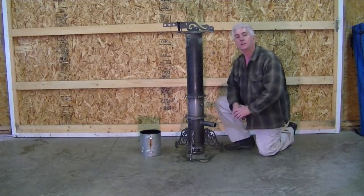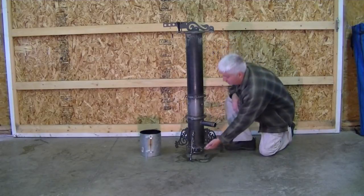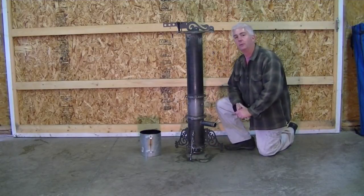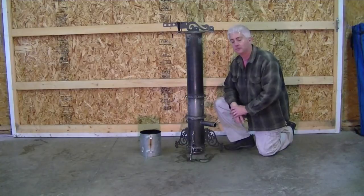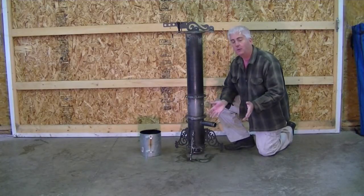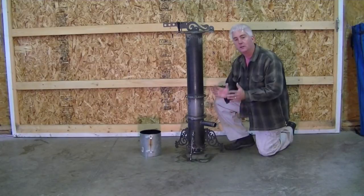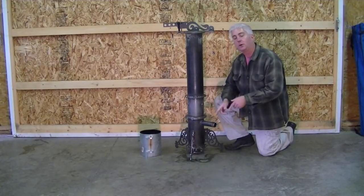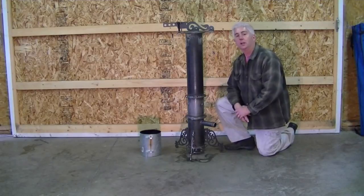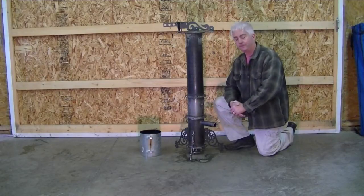First things first, she finally gets the long overdue ash cleanout, and it's the bottom plate — you undo the bottom flange, the bottom comes off, and you clean her out from the bottom. Why did I do that? Certainly on the side would have been more convenient ergonomically. The simple reason is almost every cleanout leaks — it's a habitual weak point in most gasifiers. So I'm taking the position that mine's going to leak. If it does leak, you have air coming in that little crack and it ends up going up through a bed of charcoal — charcoal updraft. The thing acts kind of like a gasifier, so it makes it kind of forgiving.